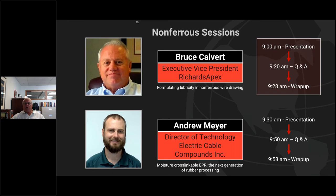Another question — capstan surface quality: what are the small dots on grade B? Porosity. You get these little pores where the surface just isn't perfect. With ceramics, it's all in the technology — how you formulate and pressurize and achieve the most uniform crystal structure.